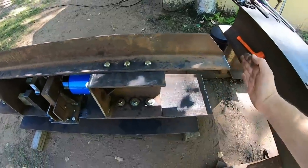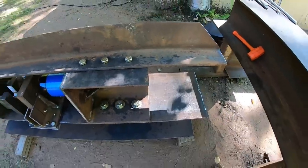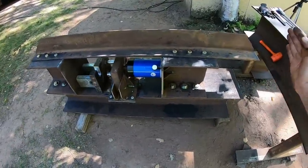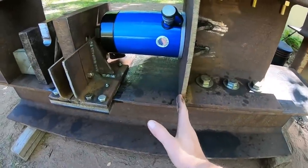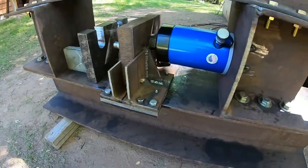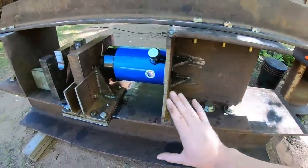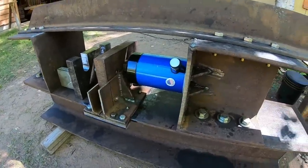And the reason we stick out further on the main H beam as well as the top support at the back is because, well, I built this entire press to be 6 feet long total, even though I only needed, well, just short of 5 feet for doing these D2 tracks. But this gives me flexibility to alter the design if I have to, because I still have not put this to use to prove it out.